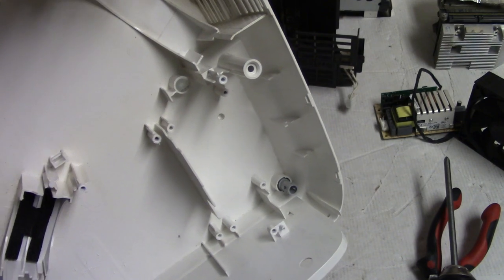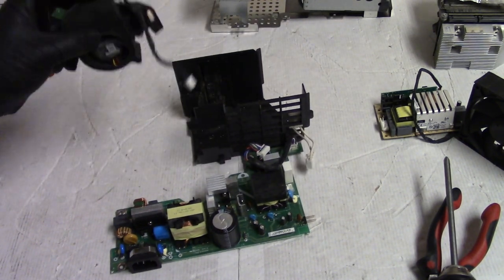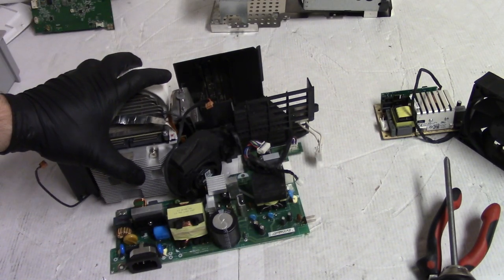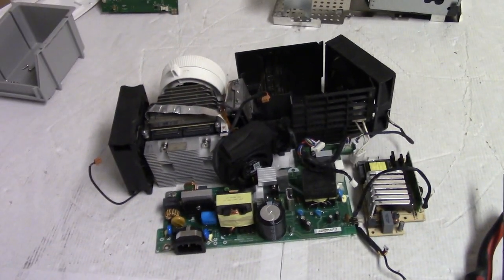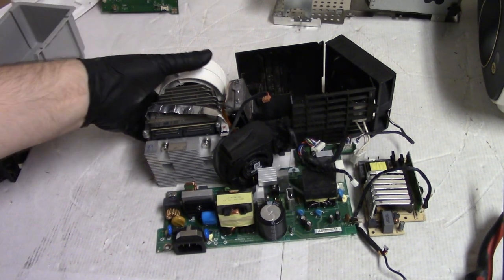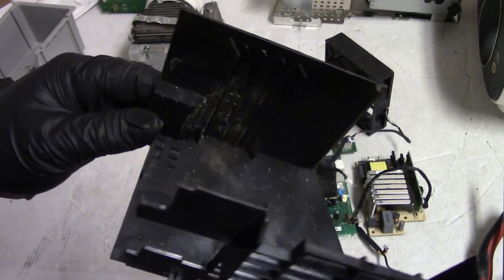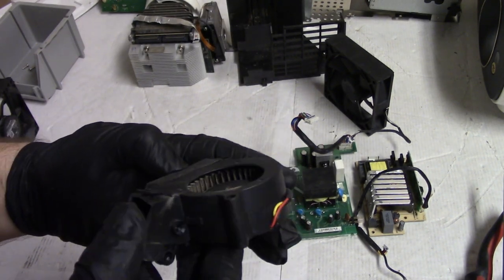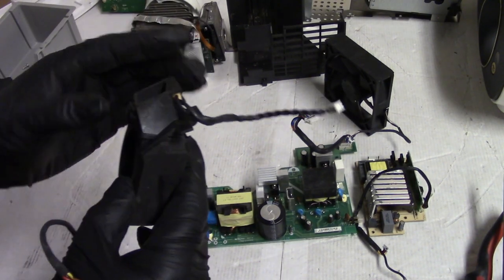So while everything is inside, it's kind of lined up like this. Yeah, basically like that, without the main board and the frame and everything. So what we're going to check, we'll clean that, we'll check this and clean the color wheel sensor, we'll get the rest of the glass and crud out of that. I think definitely overheated. And then this fan, here's the cause. This fan's just got a lot of hair and dirt stuck in it. So that's what we need to clean up.